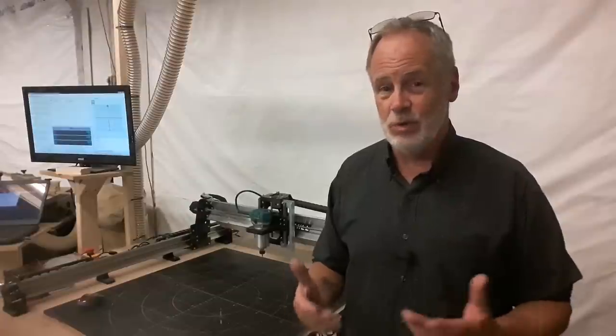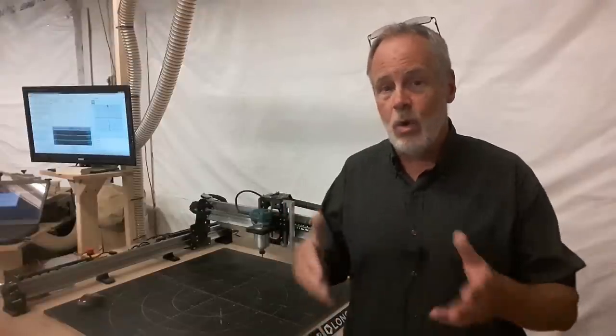The first one was the rigidity of the machine. When it comes to machine build, the worst enemy in a CNC router is rigidity. If you have a machine that lacks some rigidity, that's going to reflect in the quality of the cuts, the projects that you make. And when you have bad cut quality, you're sanding that project afterwards when you shouldn't have to. The machine should have left a near sanding-free finish. Sometimes you have to do a little bit of work to it, but not like what we left if you don't have a rigid machine. You'd spend more time sanding than you would be actually making the part. So the machine had to be very strong.